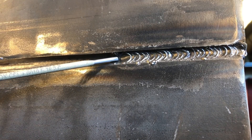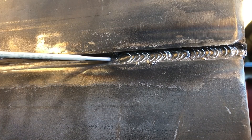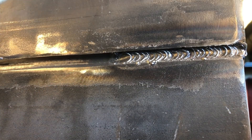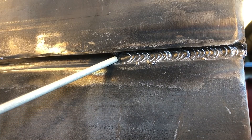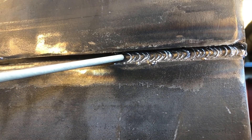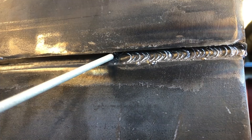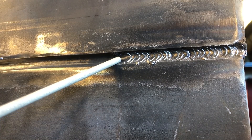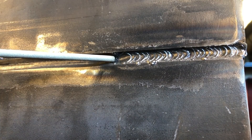Definitely take time to examine that crater. In a physical restarting scenario, I'm arcing up in my weld zone before my restart for a couple of reasons — I want to get the electrode hot and up to temperature so I don't have a cold start, and it will also preheat the base metal slightly. I'm using that last freeze line as a guide for my electrode. When making whip-and-pause motions with 6010, I let my flux follow that last freeze line to make the first teardrop, giving solid weld deposition on my crater and a seamless restart.